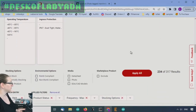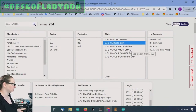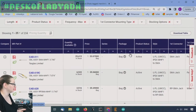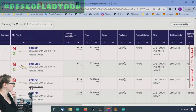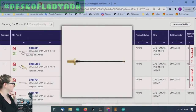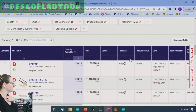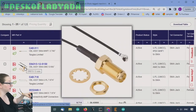Let's make sure it's a little longer than two inches. UFL — sometimes called UMCC — note that they do have RPSMA, which we don't want. We want SMA. And sometimes they have right-angle or not. You can see there are tons of these. It's just a matter of different makers and different lengths. This one looks pretty good and it's only about three bucks. Sometimes I look at what they have the most in stock of. Amphenol makes a version. You can see it's got the right UFL connector. This one from Taoglas is good too — as is TE. They're all good; all of them are going to do what you want. They just have sometimes different cabling, different height, different highest frequency. This one from Taoglas comes with an O-ring, which is perfectly fine.